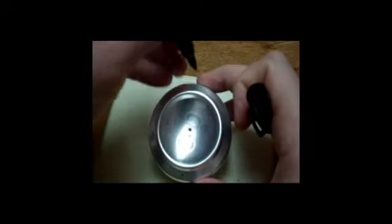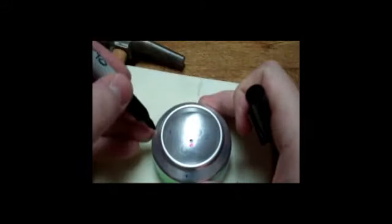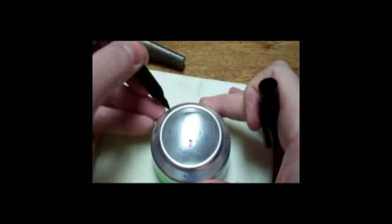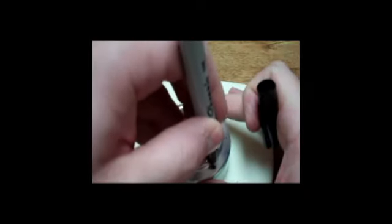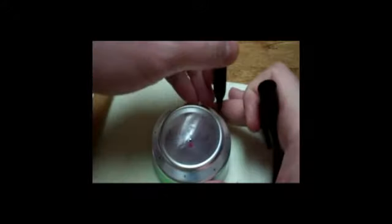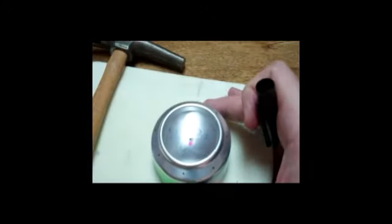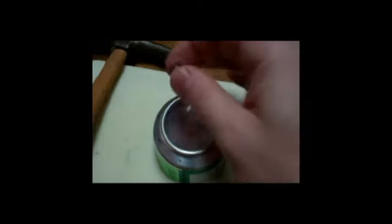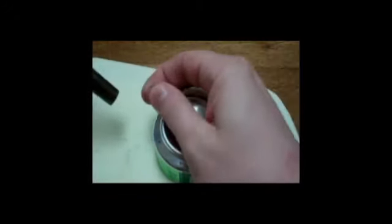Now you need to make your jet holes. Well, how many of these should you make? You know, I've tried them with more, I've tried them with less. I made one with 6, and the problem was that not all of them lit all the time. So what I had to do was put a couple more holes in, and the thing works fine. I'm just going to make this one with 8. I'm sure there's some whippersnapper somewhere that's got an equation that shows I'm wrong, but you know, it works. And so I'll make the holes.